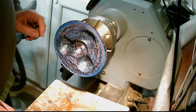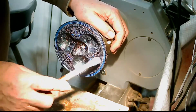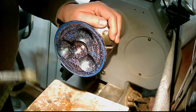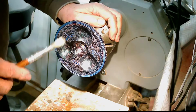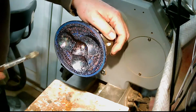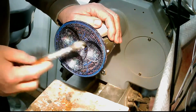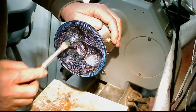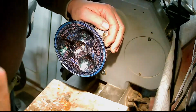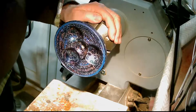So I buffed the wax back and then let it dry for a couple of hours. And because the wax felt like it was a fairly soft surface, I wanted to seal it. So this is an experiment with me using the Zinsser seal coat, which is a dewaxed shellac-based product. And I am advised that you can put shellac over wax and it won't bubble and dissolve it. I guess I'll find out whether the shellac does that or not in time. It'd be a good test piece.